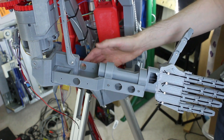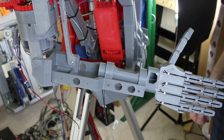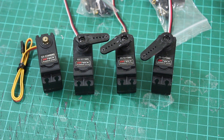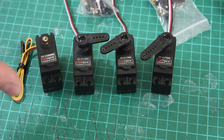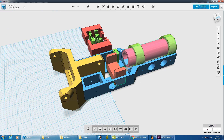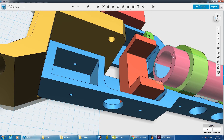Before we fit the motor we need to put all the weight in the forearm. Our forearm motion is the hand rotating and also closing, and we've got strings coming out the back. I was going to make these different lengths with different lengths of elastic so the fingers get pulled up in order, but I don't think there's going to be enough travel in my servo. There will be two servos in the forearm: one to rotate it and one to close the hand.